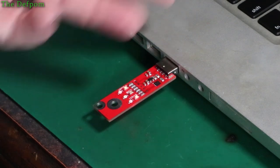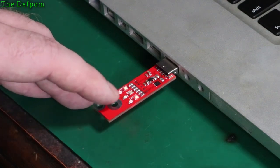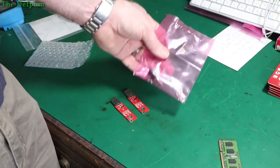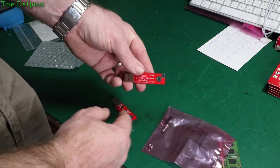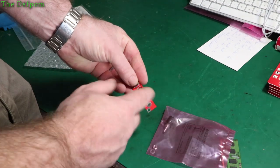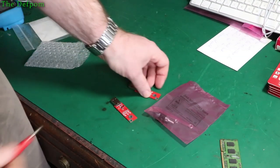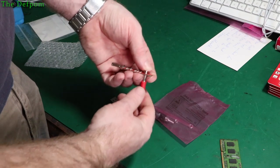If you want to verify that things are working and that you've got power to your ports, these are great. I can't remember the exact distinction between 5 volt and power - they're not both the same thing, it does mention it on the website. I'll chuck a link in below. Thank you very much Harold for sending this. The binding post is included to make testing easier - you can put it onto the board as there's a grounded pad, allowing you to stick a probe on there for zero volt reference for voltage measurements. There's also a 4mm hole so you can stick a 4mm jack straight into it.